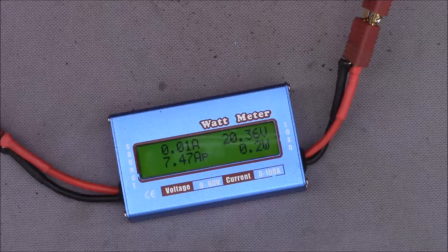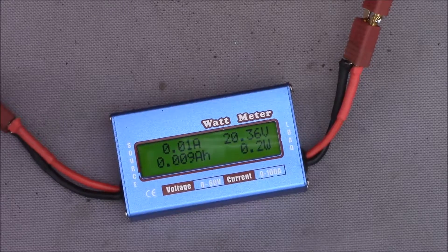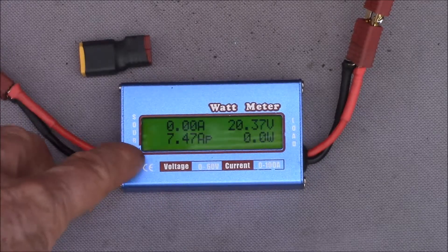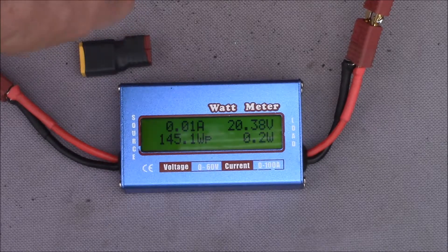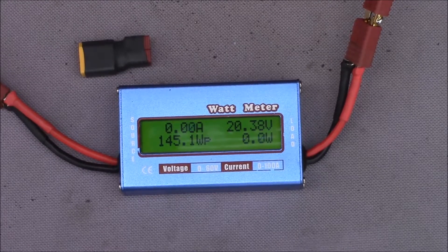At least part of the adapter works. I'll clean up these gender changers and put heat shrink on them. So anyway, there's my little Craftsman C3 battery breakout adapter — it lets me run a power tool, and I can measure power coming out. The next step is to figure out how to measure power going in and figure out what those two side terminals do to understand how the charger talks to the batteries. I'll get back to you when I have something to report. Thanks for watching.